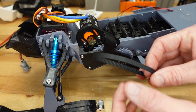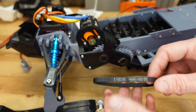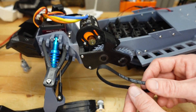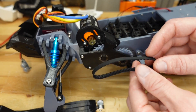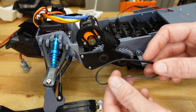You're also going to need a belt. This one here is a 200mm belt, and that's the recommended size to go with. Depending on the size of your spur and pinion you might need a slight modification to that, but in general 200mm is a good place to start. This is also a 6mm wide belt, and the pinion, spur, and belt are all GT2 teeth.